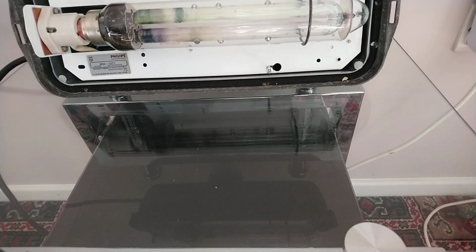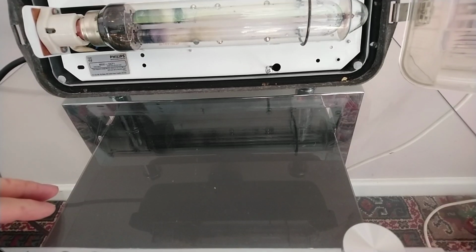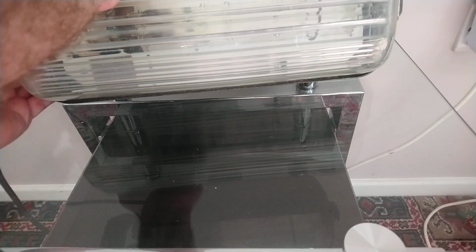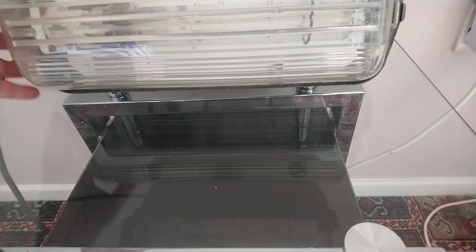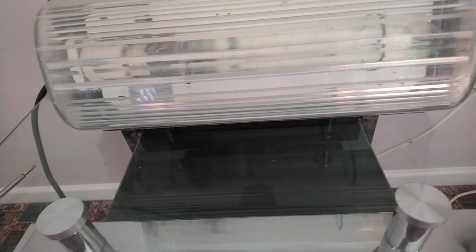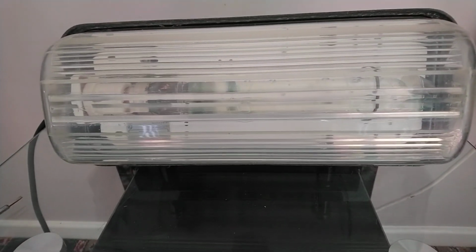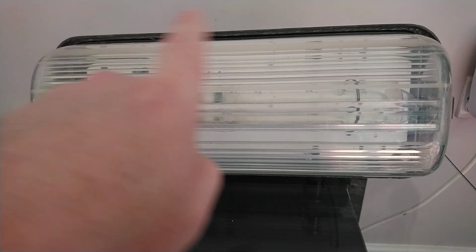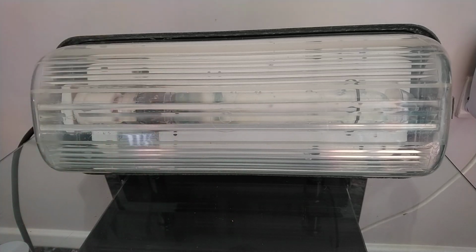Again, hook it on the hinge side, and clip it on. Now this one obviously has metal clips, but if you have one with plastic clips, just be careful with it. The bowls themselves are normally in good condition on these lights. Can yellow slightly if you've got the 70-watt high pressure version of these. You sometimes get a burn mark back here where the high pressure bulb is, but this is the sodium version, and sodium tubes or lamps do not get that hot.